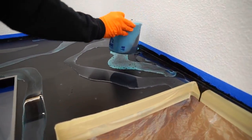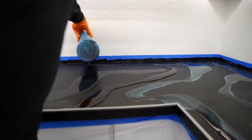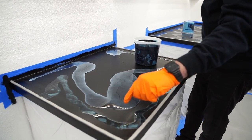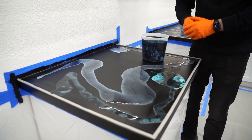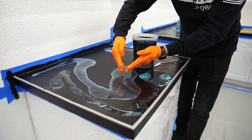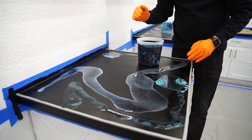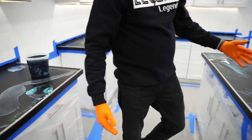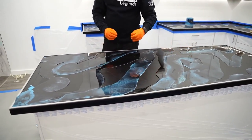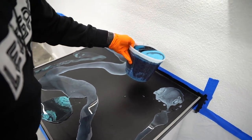The biggest thing when you're pouring out your containers is we want to fill in bigger spots. I don't want to pour a bead right next to another big bead — I want to fill in the larger areas. When we get down to our last two buckets, start fine-tuning your pours, smaller pours, trying to fill in the larger open areas. This bead was probably that big when I poured it, but after a few minutes it levels out. That's why we don't want to pour right next to beads — fill in spots. You can see how they're starting to touch because it's leveling out, and that'll help you get an even amount of resin throughout your tops.